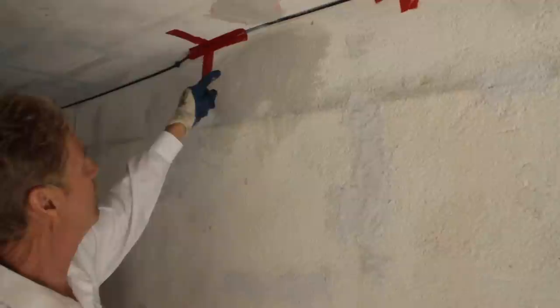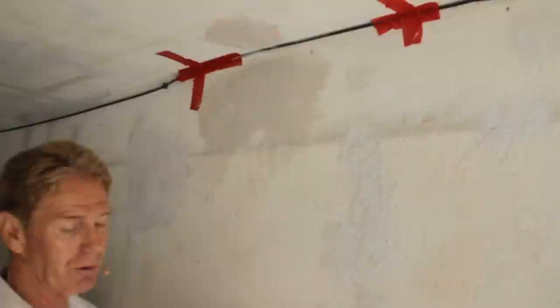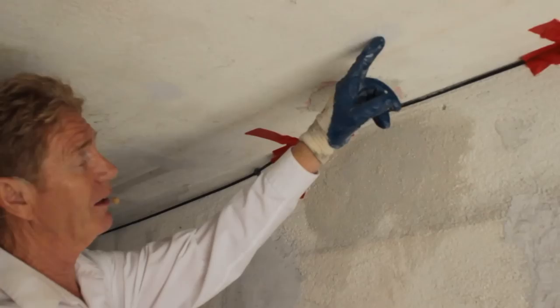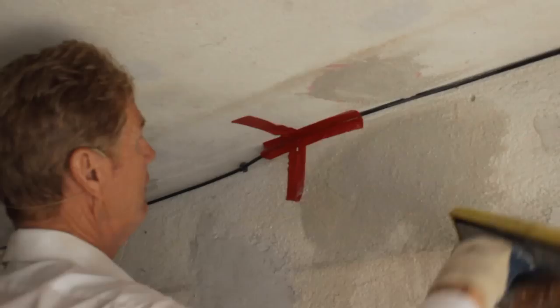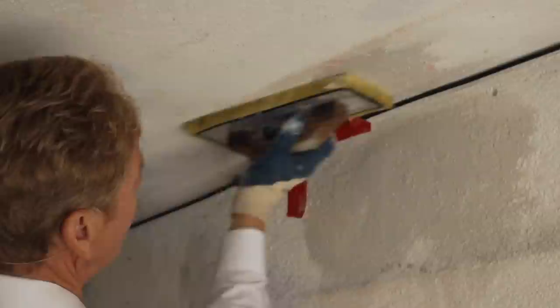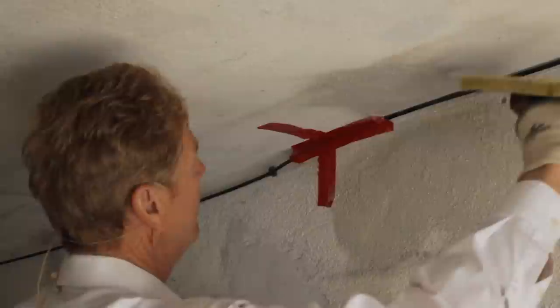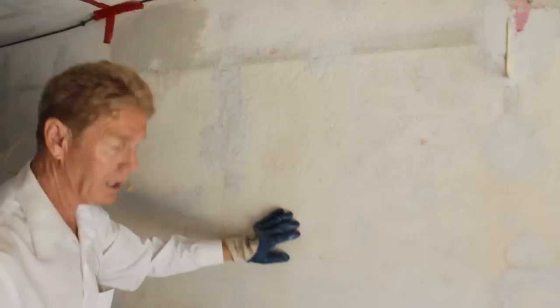For this little bitty patch — if you're doing this yourself, you take a sponge float. It doesn't matter what color — green, orange — it doesn't matter. What you do is you float it in. There are no other patches around here. So what we're doing is taking it on its flat side and just feathering it in. We take some of the material from inside the patch and bring it around the perimeter so that when we're done it looks prettier. These guys plugged it, but it's not pretty. I'm out of water, so I'm going to add some water.